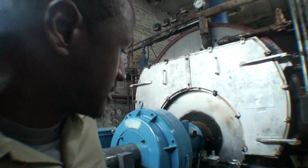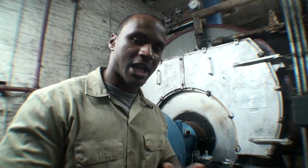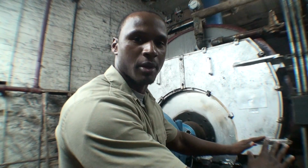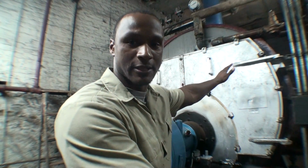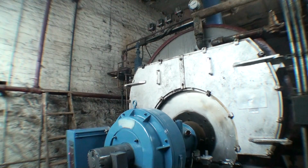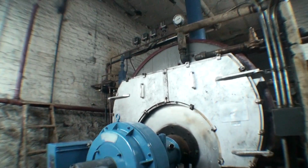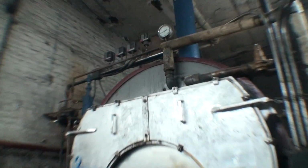Any burner that's sophisticated of this type will operate in the same manner. It'll come on and off as desired, but before it comes on, it'll always leave a pre-purge and a post-purge, and that's for safety features to push unwanted gases out of the combustion chamber through your flue venting pipes and out into the atmospheric air outside the building. And I did mention that this boiler will come back on at around 4 pounds of steam pressure, so the gauge is now starting to drop down.